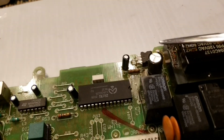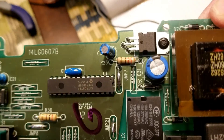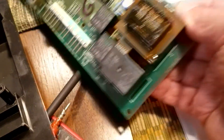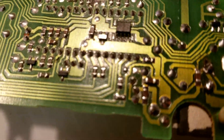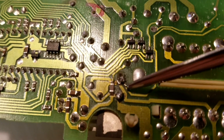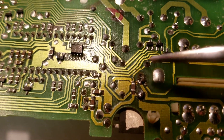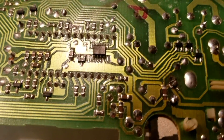I have replaced the capacitor — C22 on mine. Oddly enough, I have another board and on that one it's not even C22, it's C31. They're supposed to be the same, and the company I bought it from says it should work in my garage door opener, but it does not. I'm hoping this fixes my problem. I did caution you about soldering and being careful — I tried to be careful, but these little circuits just opened up and kind of melted and popped out. I ran some continuity tests, compared it to the other board, and everything seems to be okay. I've just got my fingers crossed, so I'm going to put it all back together and stick it back up in the opener and see what happens.